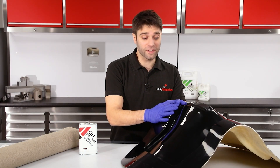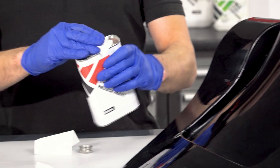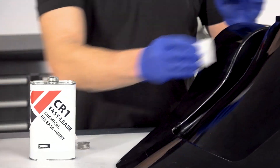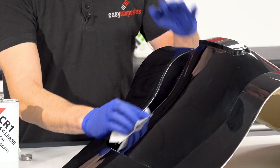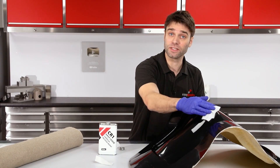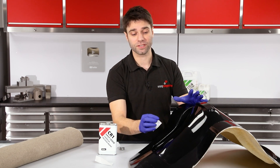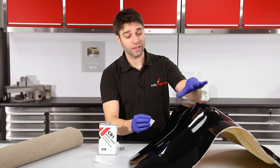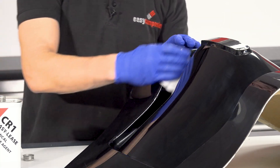This is the mould for the seat, made using the Unimould tooling system. The first thing we need to do is apply the release agent. I'm using CR1 Easy Lease Chemical Release Agent, applied in the same way as you'll have seen in many previous videos — just wiping a thin film over the surface, wiping with a dry cloth if there are any runs, and repeating this six times leaving 10 to 15 minutes between coats.